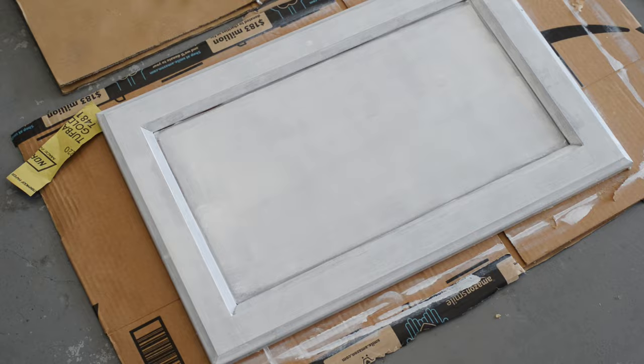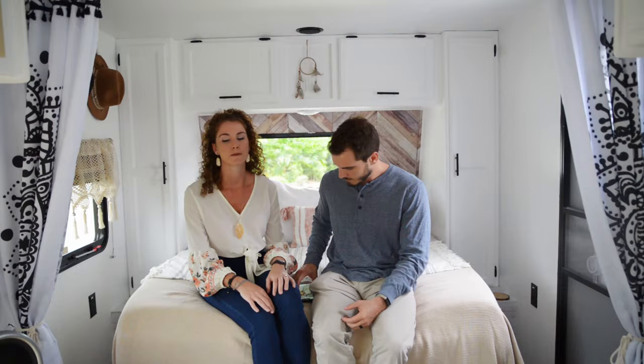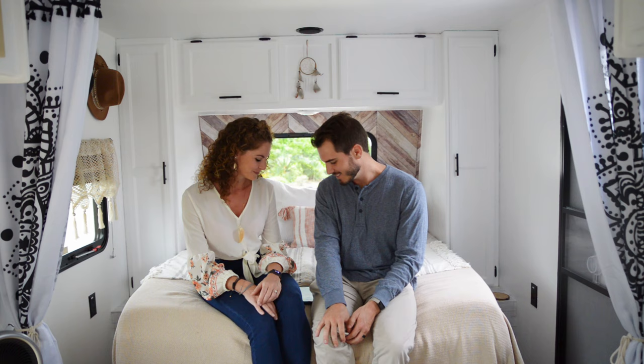Step number seven: we used two coats of primer. The brand we used was Zinsser, which is supposed to stick to any kind of surface — including smooth, glossy surfaces that aren't normally meant to be painted, like these RV cabinets. The cabinets are a veneered wood, really smooth and glossy, so this primer worked well. We did two coats and felt that was enough, though you could do more. We were also excited to get to the painting.